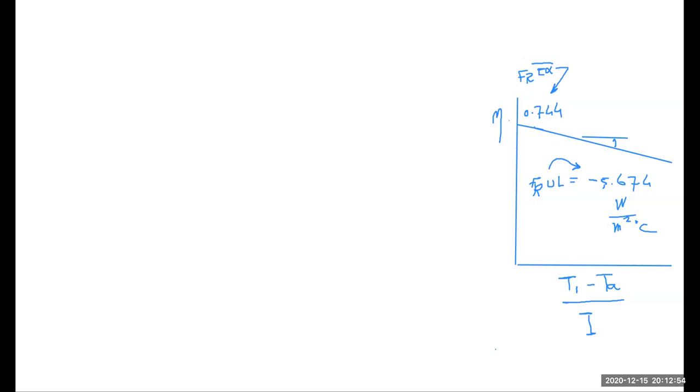So now the thing that we need to consider here is one example. I just picked up one of the problems at the end of the chapter. Before I show you the problem, I'll show you how the solar collector efficiencies are accounted for. Some people would not accept this straight line, and they may go for something like this, which is a second order polynomial. That's what I'm saying, that it does not make a big difference actually. When you go from one collector to the other, you will find that some collectors have this shape.